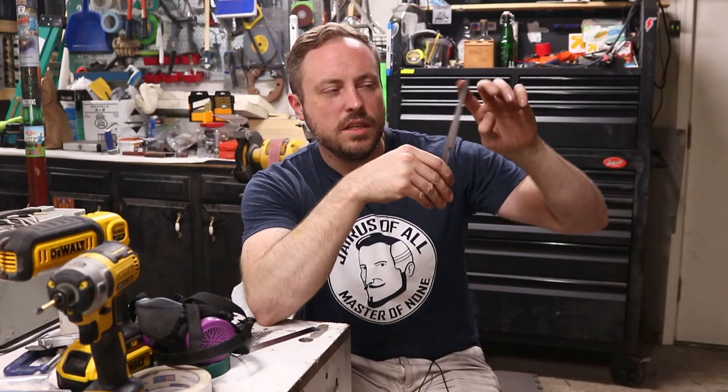With this having a super tiny tip at the end, I know it's going to be a little difficult because that'll get hot easily and I'll lose my temper if I'm not careful when grinding at the end. But this is really thick material. I think I might have to grind it down. I want this to be a very sharp little knife, so I might end up doing this bevel just to make sure it's flat and nice, and then take the thickness down — which would be a lot of sanding, but it would make it what I want.